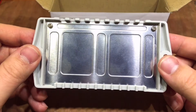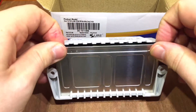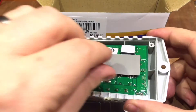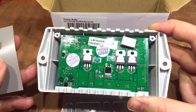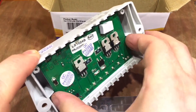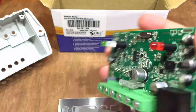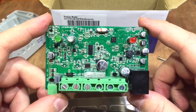Before I turn this on, let's open it up. The screws are out and that metal plate can be pulled out — there we go. As I expected, there are the MOSFETs: that's probably the load MOSFET on the left-hand side and the solar panel MOSFETs on the right-hand side. It seems to be a common negative. The board pops out too — it's a fairly standard EP Solar charge controller layout.